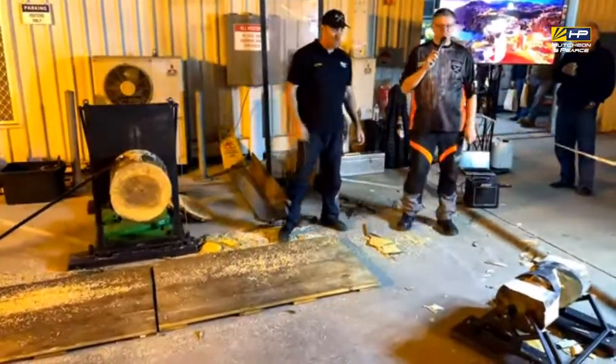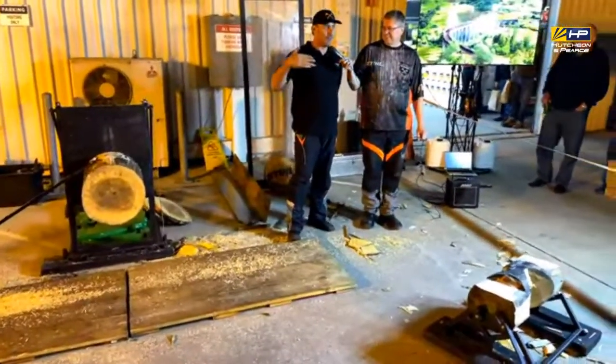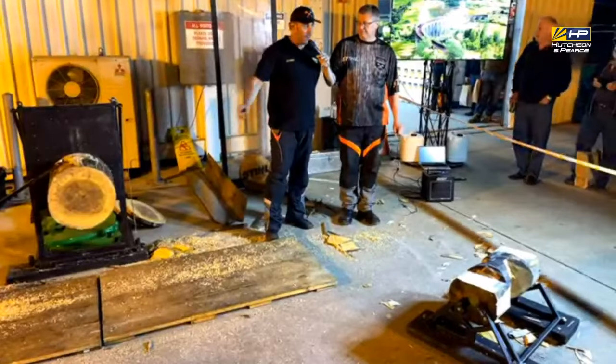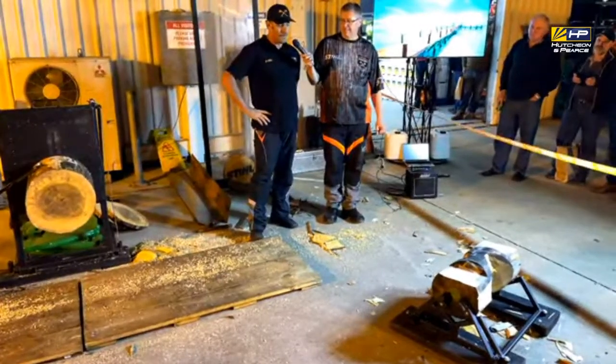So, Brad's obviously been doing it for a while. Yeah, no, there is a fair technique in that, and as you've seen, they have that big jag up towards the bottom, it's really important to keep the saw straight all the way through. They went very good. It's just as you get to the bottom, there's less of the saw on the log, so it's not easy to avoid a jag, which is what I'm doing. So you just got to make sure you concentrate all the way through.